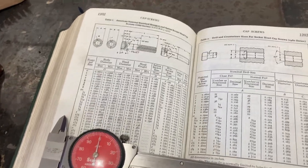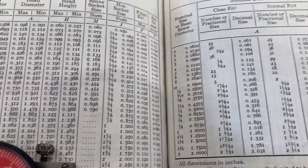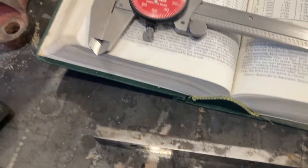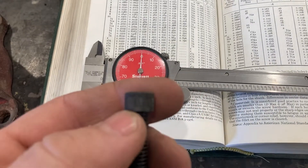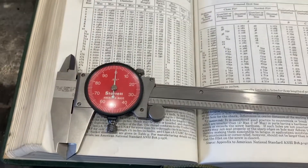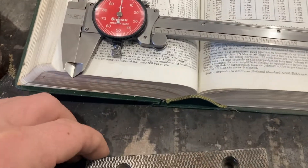What you find in the Machinery's Handbook is they give you all the information for this kind of thing. If we use a quarter-20 thread, we've got plenty of meat in the removable jaw section using a 3/8-inch piece of material to have the socket head cap screw below flush. This is a 5/16ths socket head cap screw — the head length is 5/16ths and the thread is also 5/16ths. So we just need to make sure with a quarter-20 thread that we sink below a quarter inch, and since this is 3/8, we've got the meat to do it. I think it's a better plan and less likely that the kids will strip these out again. So let's make a new set of jaws.